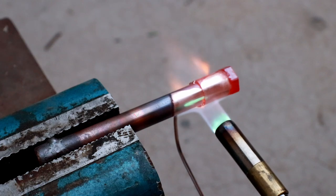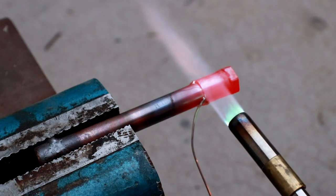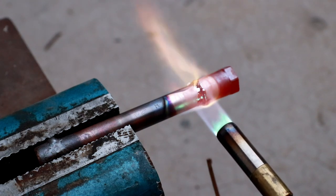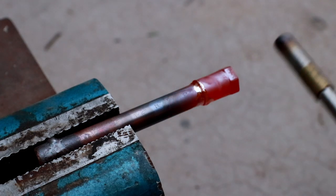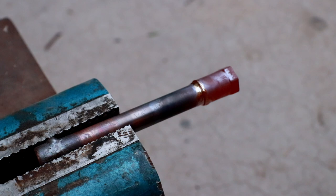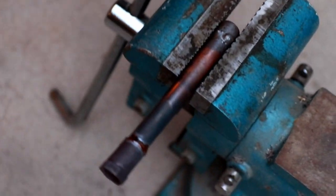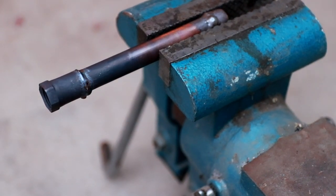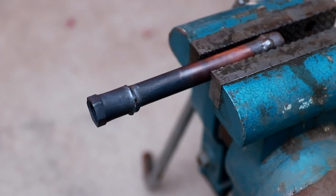How about that — let's go have a look once this gets a little bit cooler and see how it looks on all sides. You can see the braze made it on this side, and going around to the other side it looks like it made it most of the way around — actually all the way around with only that 90-degree angle of torch application and a limited window of rod implementation.